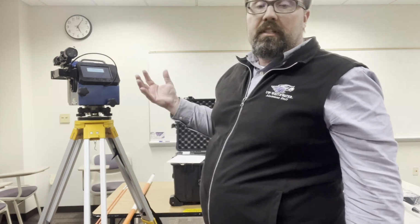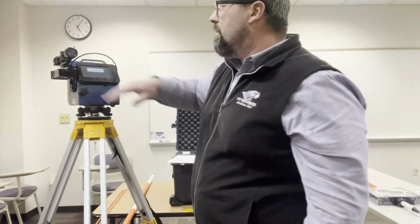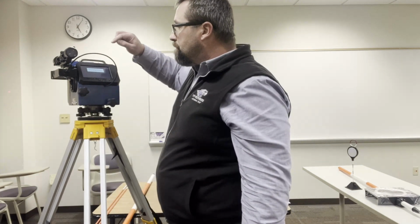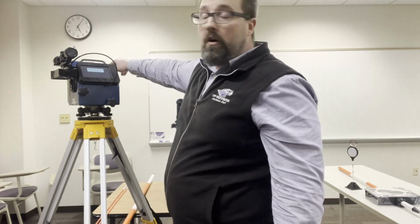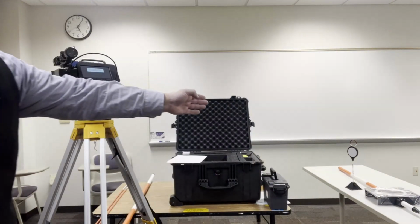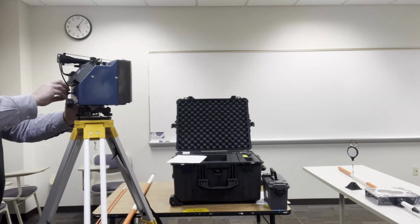And so then my first step is going to be just reading the instructions, right? So level laser, press OK when level. So I've got my laser level according to my bubble there. I'm going to click OK. Now it says aim at circle center, press OK when done. So I can see my laser dot on the wall ahead. I've got my circle center set up on the table over here. You can see my white stationary point. So rotate through.